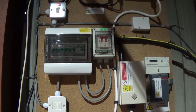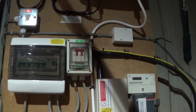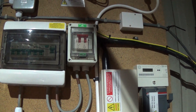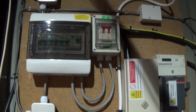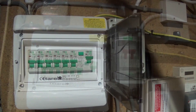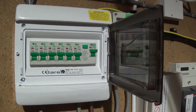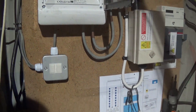When I first came here there was some god-awful Frankenstein type fuse board here which I've got rid of. The first thing I installed in the line was a double pole switch so that I could completely isolate the barn from that cable, and then I used a couple of meter tails to go into this garage type fuse board, which has a 63 amp RCD and various MCBs in it. I'll whip the cover off and see what's available, and then I'll be able to mount a 16 amp socket.